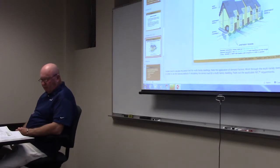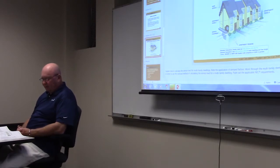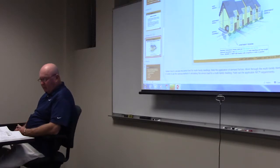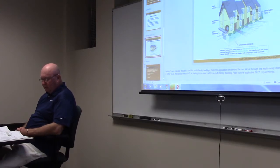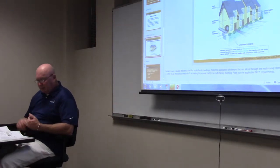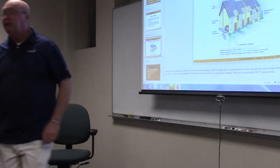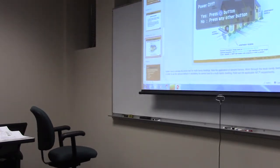So if we look on page 24, you got a 30-unit apartment, 18 of 650 square foot, 6 of 775, 6 of 950. The kitchen in each unit contains the following loads. We got a 7.5 kW range. We got a 1250 dishwasher. We got a third horsepower garbage disposal. And we got an air conditioning unit rated for how much? 3600. 3600 volt amps.